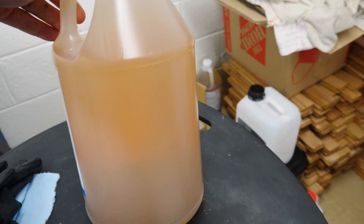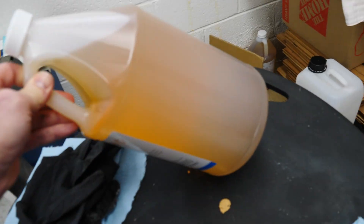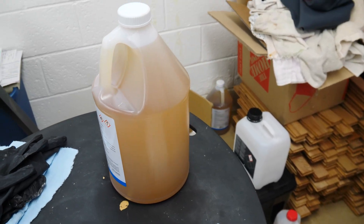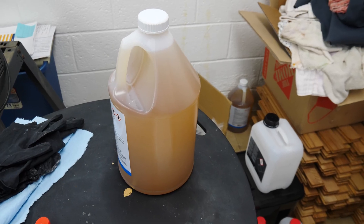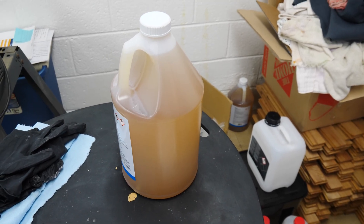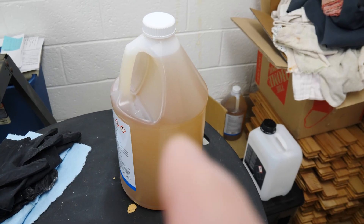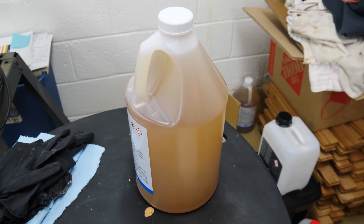It's really starting to set in — this is the IPA. At some point I can't get it any cleaner than this. It's slimy and slippery, and I've got plenty of it, but what am I going to do with it? I can't use it anymore to wash resin prints. The hard truths of this filtration system are clear: it has its limitations. Does it work? Yes, but ultimately you've got to swap the IPA out.